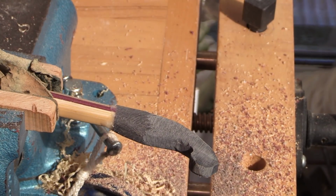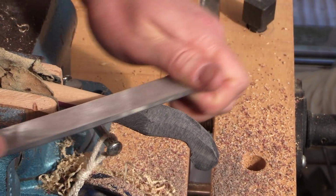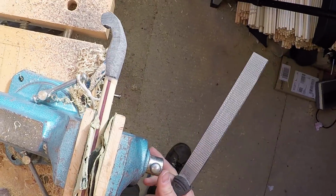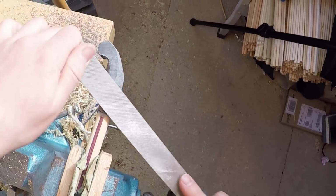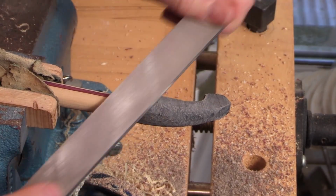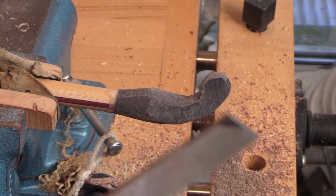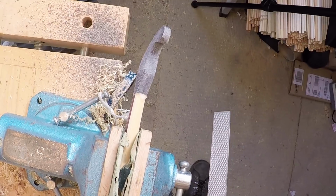As I say, we're on the finishing stages, so the bow is pretty much tailored to how I want it to be, and now I'm working on actually getting the nocks to the shape that I'd like them to be, getting the fit correct, the narrowing of the end of the bow there and where it meets into the nock. I'm conscious that I need to get that step free so that it smoothly moves from the diameter of the bow into the socket and into where the nock lip is. So it's more aesthetically pleasing and also functional when you're trying to brace the English longbow. The string loop has to move up the bow, up past the nock where it sits, that join, and up into the groove which I'll eventually put into this nock.